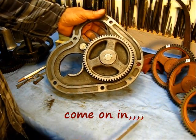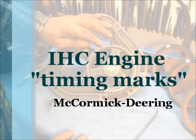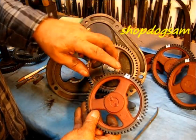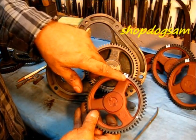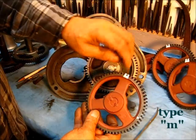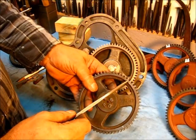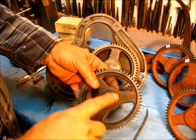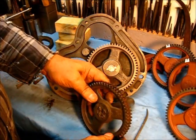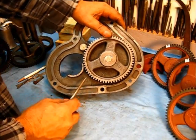This is something I discovered today that I want to bring to your attention. The timing marks on these cam gears are marked with two sharp pointed chisel marks — two teeth will have a mark on them, two indents. Most of the time they look professional, but occasionally you'll find one a little bit askew. I've found a couple where the indents were not uniform.